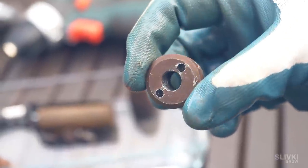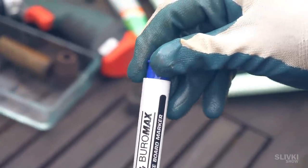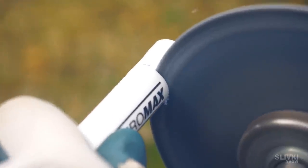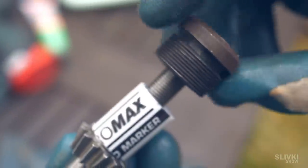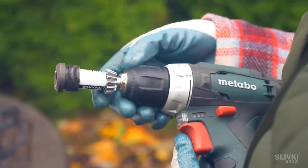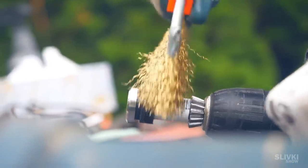Now let's get to the bottom part of the chuck. At first we planned to weld those holes, but then we thought they didn't look so bad, and in the future no one would struggle with unscrewing it again. We cut off a piece from the body of an old marker and put it on the shaft we cleaned earlier. We screw the cap on top so it rests against the marker, keeping the shaft from sticking out. Then we put it all in the drill and clean the circles from rust using sandpaper. We clean the threads with a wire brush. Done!